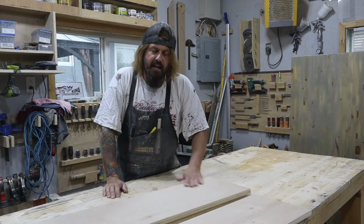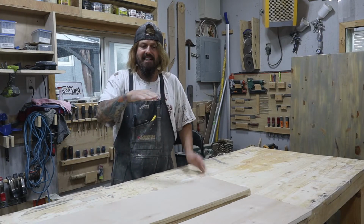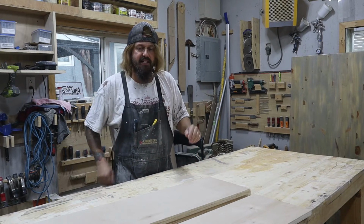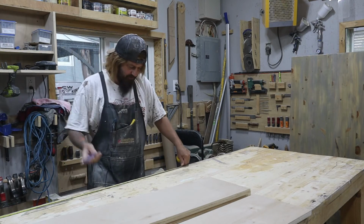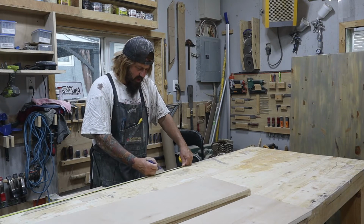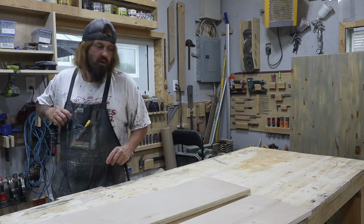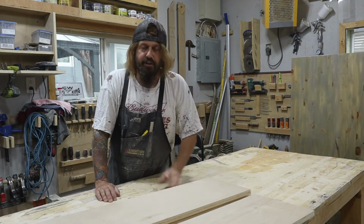The top is cut. Now we're going to cut the bottom piece. It's going to be a little bit smaller because the bottom piece is going to sit in between the 2 sides. Allow 3/4 of an inch and 3/4 of an inch. It's going to bring it down to 32, I believe. So we got 34 inches minus 3/4 minus another 3/4. We're cutting it at 32 1/4, and we're going to cut that on the miter saw as well. Sorry, that piece was cut at 32 1/2.